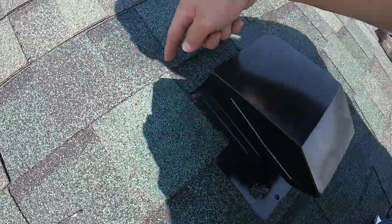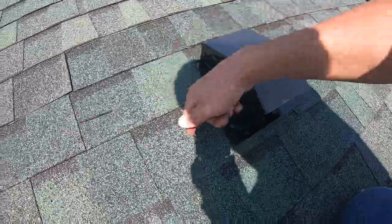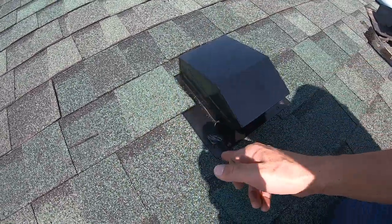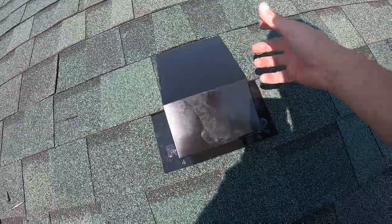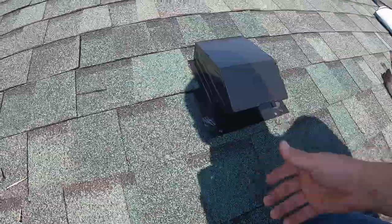There is sealer down and around this so it's not going to back up — and if it does, you've got plenty of the shingle and the headlap up under it. Anything coming under this edge has sealer underneath along the flange down the sides. If any water did get underneath for some reason — condensation, whatever — it'll trickle out those little areas. But it's also pinned down, so you're not going to get any wind-driven rain up in there.